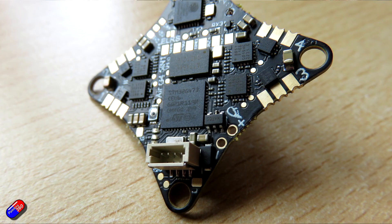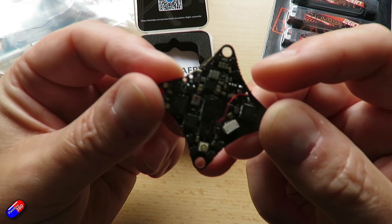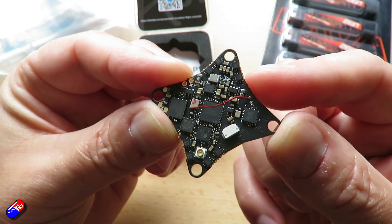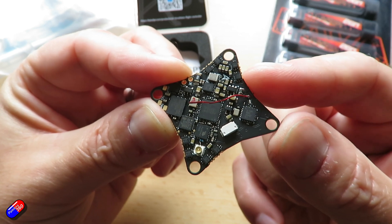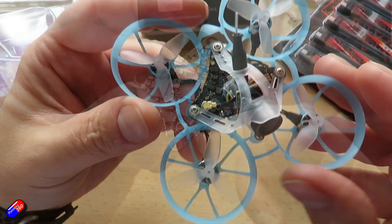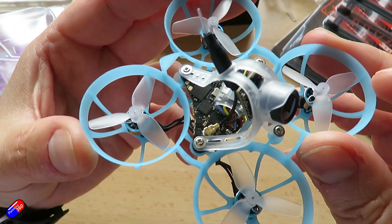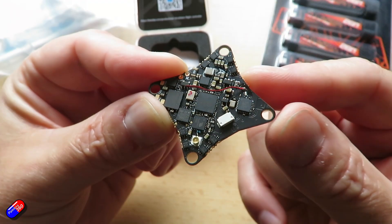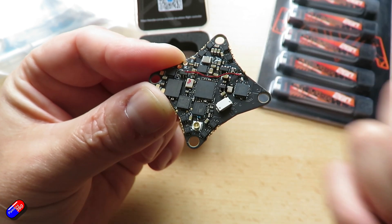There's an SH 1.0 4-pin connector, and a built-in ESC that will continuously deliver 5 amps. The receiver is a serial ExpressLRS 2.4 — only on this 5-in-1 version — running firmware 3.4.2. The 4-in-1 version that shipped with the original quad had the flight controller, ESC, on-screen display, and VTX. This new 5-in-1 version adds the receiver too.